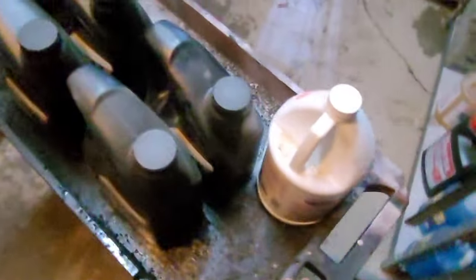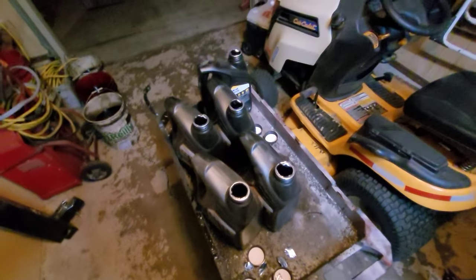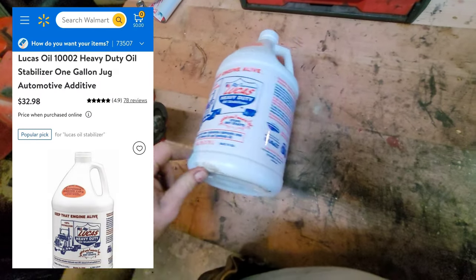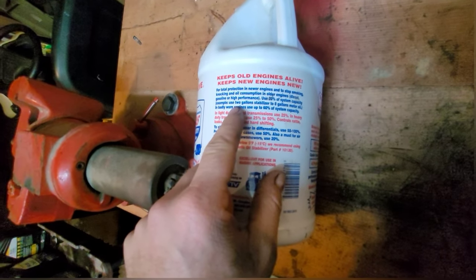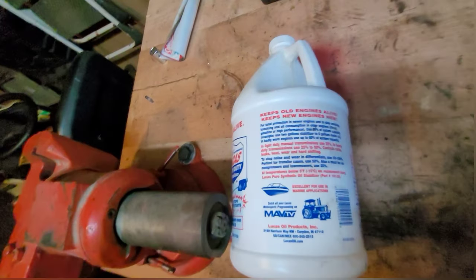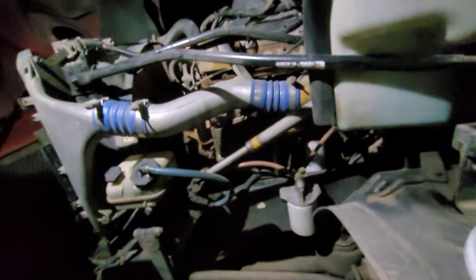We just came back from Atwoods. Let's wheel this bad boy out here and start putting in the new oil. While we're in here in the light, let's go ahead and take the caps off so they're ready to pour into the motor. I always use at least a gallon of Lucas oil stabilizer in every oil change. It says use 20% of system capacity, so about two gallons for eight gallons of oil, but I just stick one gallon in for 10 gallons. If you're working in the dark, a good place to hang your light is right up there on the fender.